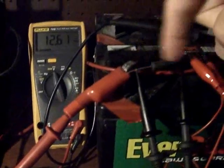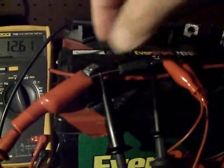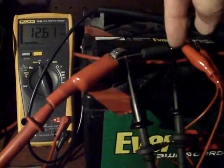I have one coming off the positive terminal, and then these two leads — one is going to the top of the load resistor, and one is going directly through the pot and then to the positive rail of the timer circuit. I have channels 1 and 2 across both sides while the ground is going straight to the negative terminal on the battery, and this is to measure the positive side before and after the shunt.